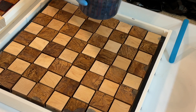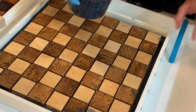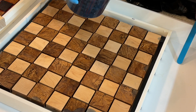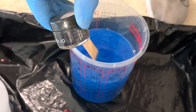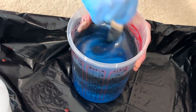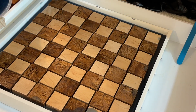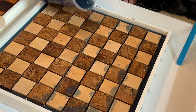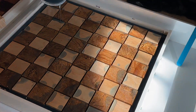I added the board into my chessboard mold and readied it for the epoxy pour. By the way, you can check out my video on how to build these chessboard molds, which will save you lots of time in the build process. For the accent epoxy, I used a royal blue pigment from Rolio, which is sold on Amazon. I then added a little bit of black pigment to darken it up just a little. After mixing it up, I poured the epoxy between the squares and along the edges of the board, and used a weight to keep the board from floating in the epoxy. Believe it or not, even a heavy board will float up once you put enough liquid epoxy in there.